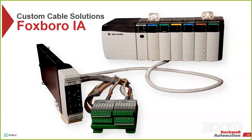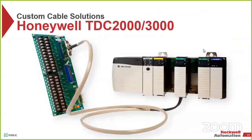That's the Foxboro I/A cable. We'll take that existing cable and tie it in directly into our DC input card. Honeywell TDC is usually the biggest one that we see here in the market. Same thing, big, gigantic green board, big, gigantic serial cable, just plug it in directly.